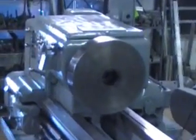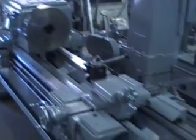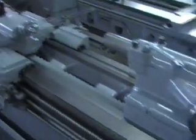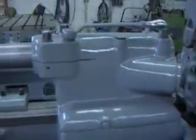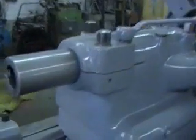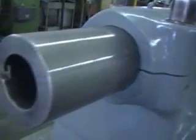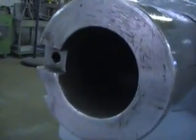Very nice and smooth — 400 RPM, that's the top speed right there. Let me catch up with you on that tailstock and show you how simple that is to run. Very nice. I'd like to point out how nice this quill is on the tailstock — there's a number 6 Morse taper in the bore. Beautiful.